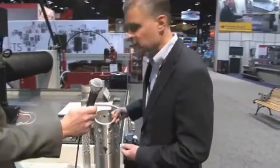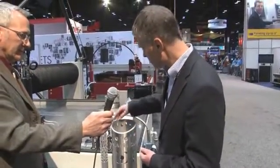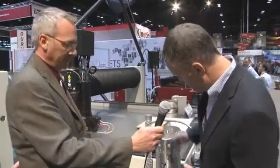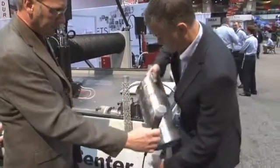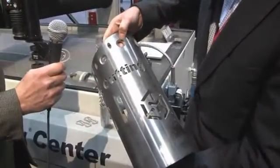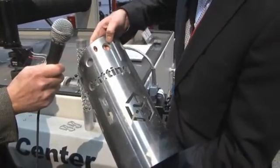Water jets are a relatively easy-to-use machine tool, and one of the reasons is the software that we and other water jet manufacturers have developed — I'll get into that a bit later. Some of the applications for this water jet range from these examples of pipes displayed here in the booth. You can put nice bevel angles on the end of a pipe. If you're mating it at an angle with another pipe, you can put angled holes in the pipe itself. This is with the addition of a rotary and a five-axis cutting head.